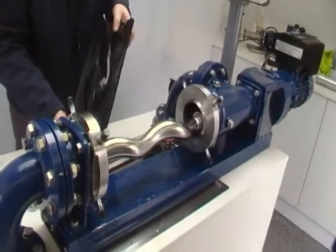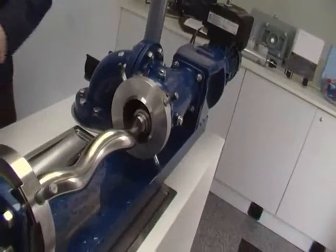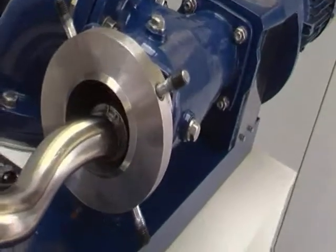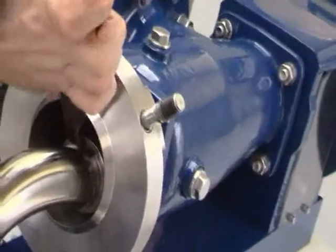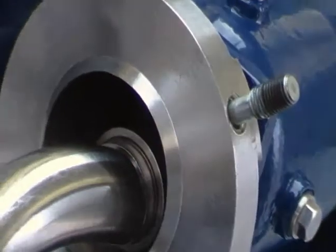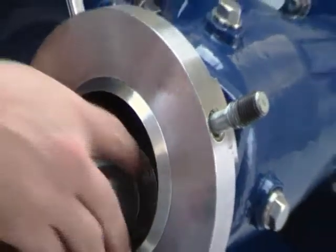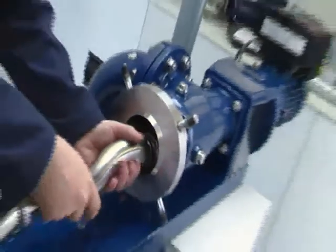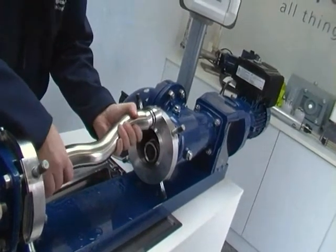The SCT pump also incorporates a smart rotor. This has a quick release detachable geometry. The rotor head and universal joint remain in position, and by simply removing a circlip, support ring and locking plate, which is housed inside a groove in the rotor head, allows the geometry to be removed from the rotor head. There is no need to touch either the suction pipework or the suction casing.